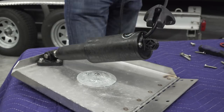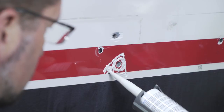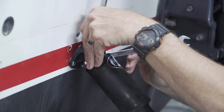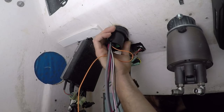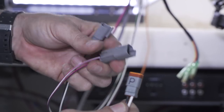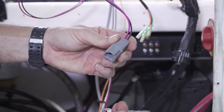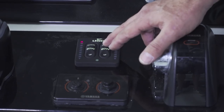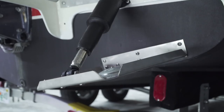Now we're going to assemble our actuator to our tab and begin our installation. We're going to apply some sealant in the area where we drilled the holes. Now we're going to begin installing the fasteners for the tab. We're going to pass the wire forward through the transom and then begin mounting the upper bracket. Now we'll install the upper fastener that connects the actuator to the upper mounting bracket. Now we're going to begin installing the switch — hand tightening the bezel nut on the back to secure it in place. Kevin is connecting the wires with the red tracers to the port side and the wires with the green tracers to the starboard side. The power pigtail should be connected through a 20-amp circuit breaker or fuse. We're going to test the system to make sure it works properly.